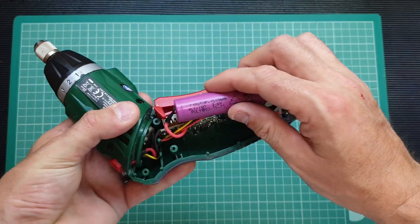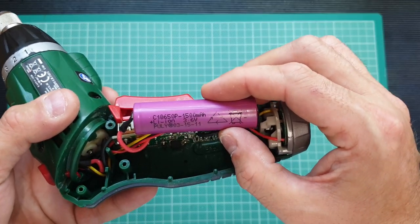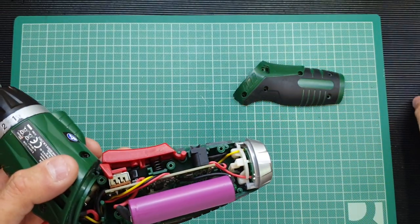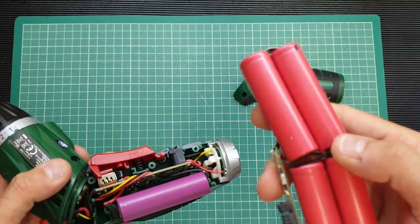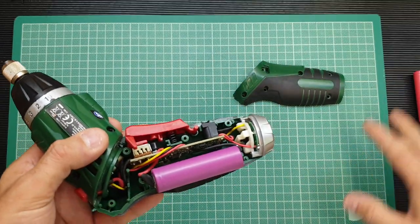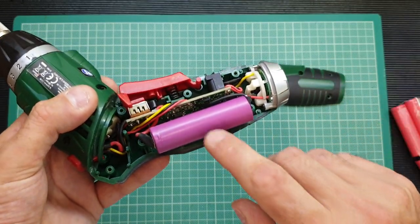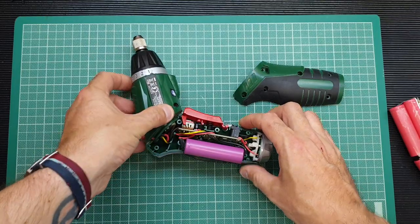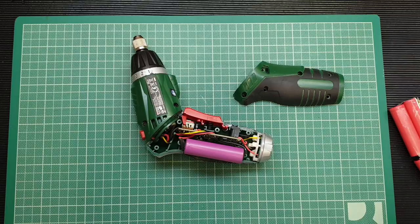I'm content that the batteries I'm going to use tonight are definitely better quality and will last longer than the one currently in it. The manufacturer of the original cell is Pulley, and it's only a 1500mAh cell. The ones I'm going to use from the pack are Sanyo 18650s with a capacity of 2100mAh — so this is far and beyond going to be better. I'll pause the video, get everything ready, and then we'll commence with the repair itself.